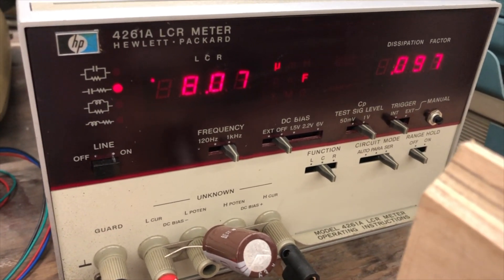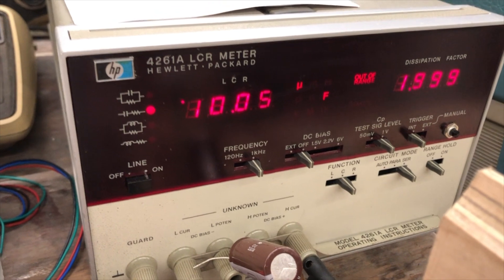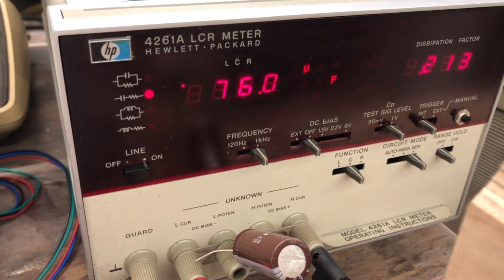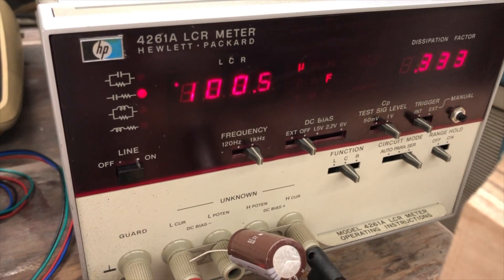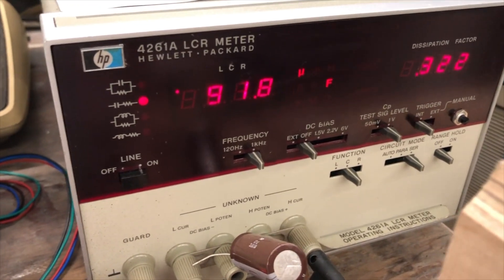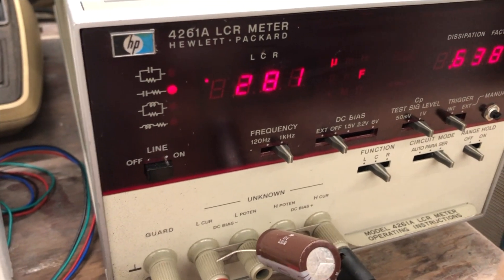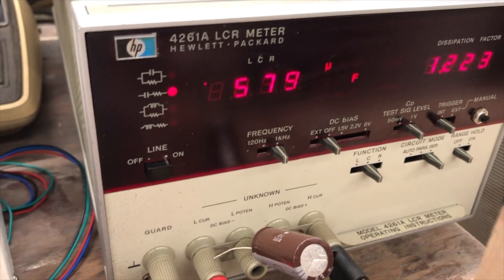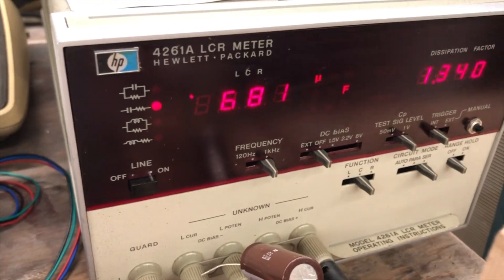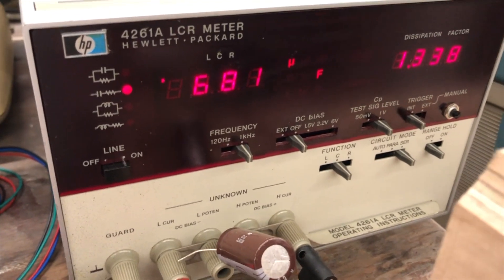Nine microfarads — oh, that's very accurate. Ten — now we're into the tens. 50, 60, 70, 80, 90, well at least it goes up — 100 microfarads. I believe I made it monotonic into the hundreds digit — actually no, I didn't. 100, 200, 300, 400, 500, 600, 700 — and seven is the highest digit I took it to; it seemed pointless putting an 800µF cap in there just for the top two settings of that digit. So there you go — the capacitor substitution box.